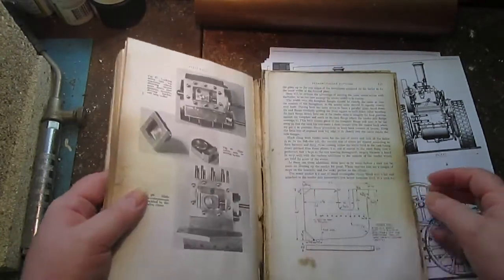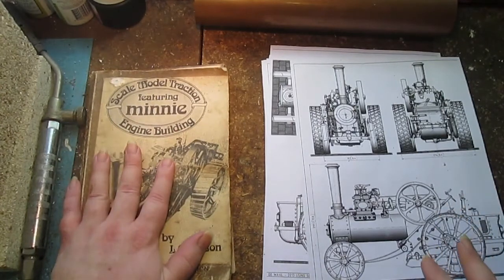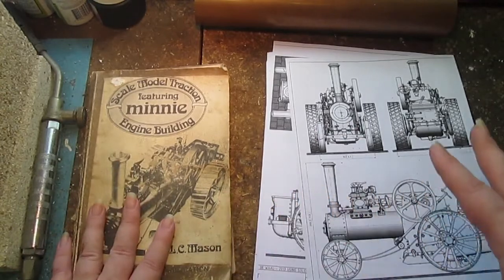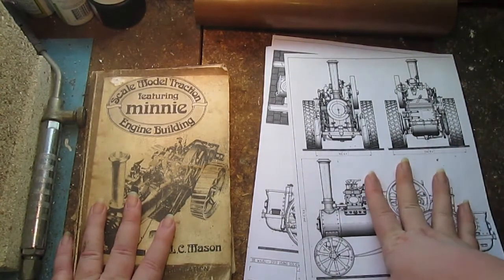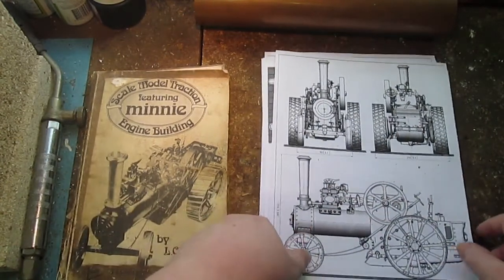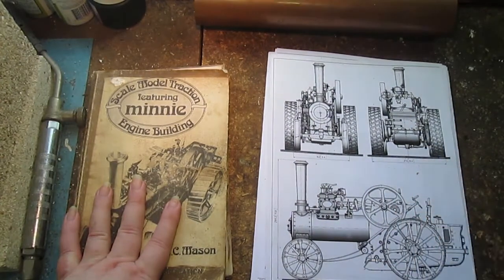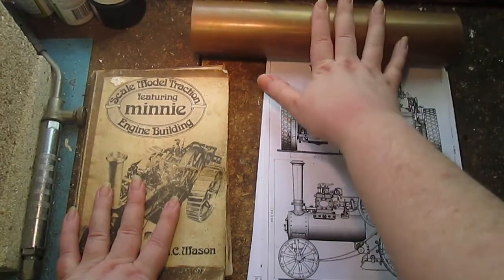Fabrication it is - it's all designed to be fabricated and in the book he discusses how to fabricate each part, which simplifies things greatly. There's also gear cutting to be done. The gears as designed were 20 DP - Imperial gears, that's diametrical pitch. The metric design also uses the same Imperial gears, and I'm half wondering if I shouldn't modify it to use metric gearing just so it becomes fully metric. Part of that is because I don't have any gear hobs, and if I'm going to buy some, it would make sense to buy metric ones for a mostly metric workshop.